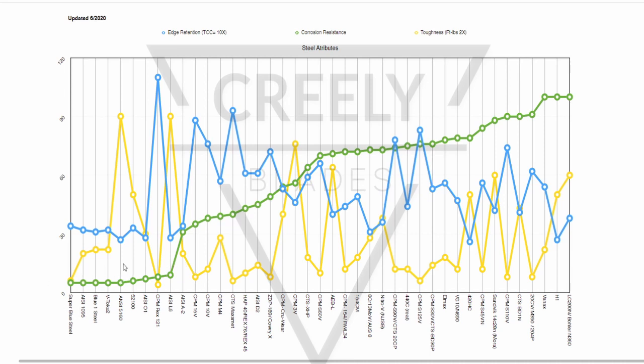So these steels here, from super blue to L6, they're just not at all corrosion resistant. Is one a little more than the other? Does somebody want to argue with me like, oh, well, 52100 should be there and 01 should be there? Stop it. It doesn't matter. They're not corrosion resistant. They're not going to be noticeably better or worse than one another.